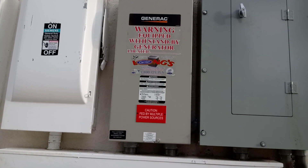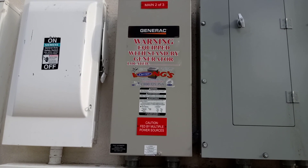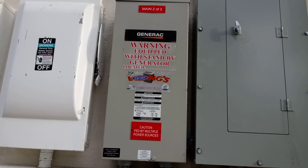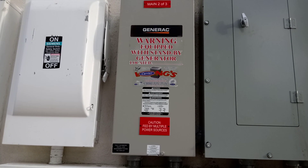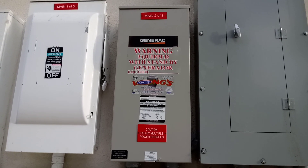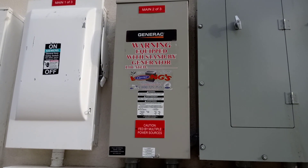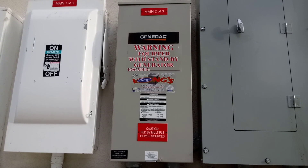The generator uses those sense wires — whenever it detects a loss of 240 volts, it turns on. So we're going to constantly feed that 240 from our inverter-protected load panel and then use a relay to drop that in order to start and stop the generator. This automatic transfer switch feeds one of the two panels inside the house.